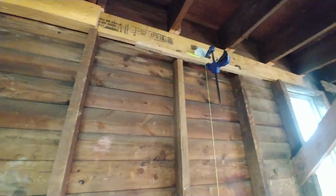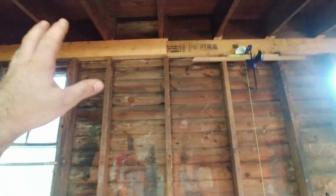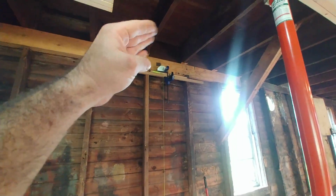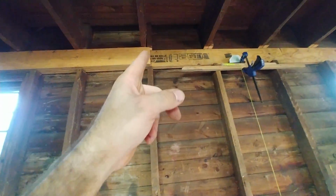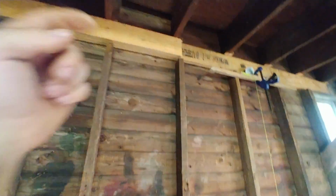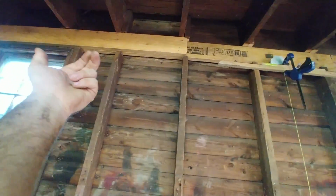However, the second bracket is ready and waiting there, and the cut off notch is tight to this beam. I messed with the lifting arrangement enough to sit that down tight. That's the most important thing, that the beam is tight to the bottom of the cut off stud and the bottom surface of the joist. So since that's where everything is, then I nailed up and into the joist with 1 diagonal ring shank nail, and I went up in the wall bay and toenailed the joist to the beam and the stud to the beam at the top. So that's all been married together. And then I went outside and I nailed through the siding, through the sheathing, and into this beam at this elevation all the way along. So this is all, once again, been married.